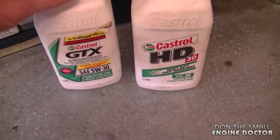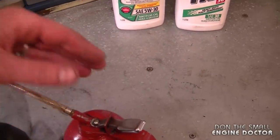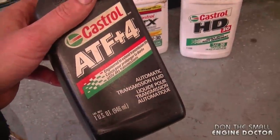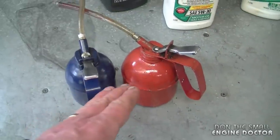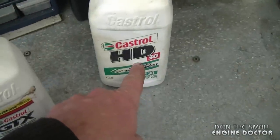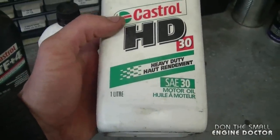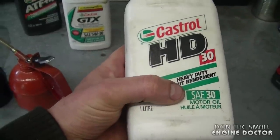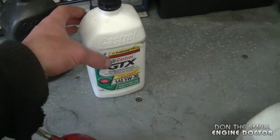For example, if I'm mixing up an oil can for the wintertime, I'm going to mix it with automatic transmission oil and 5w30 engine oil. If I'm filling them up for the summertime, I'll use automatic transmission oil mixed in with HD30 engine oil. If you don't have HD30, you can use 10w30 — it's a little bit thicker than 5w30, and because it's hotter in the summer I like to use thicker oil mixed in with the transmission oil.